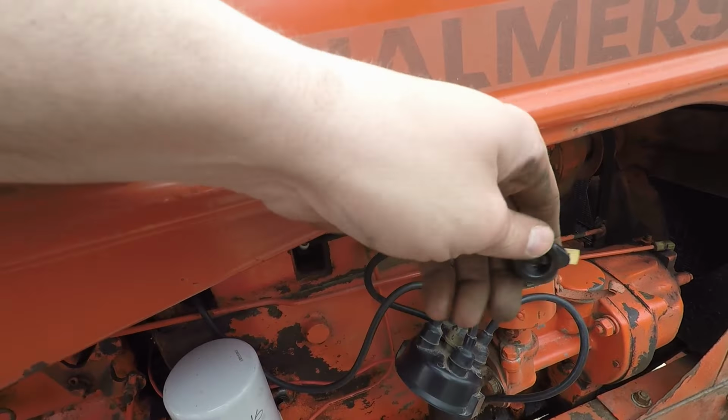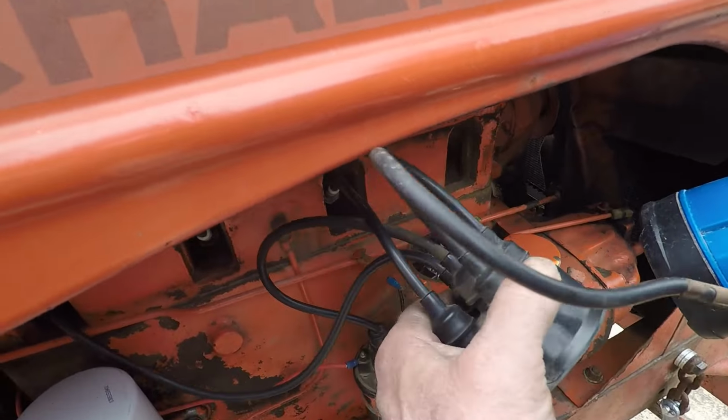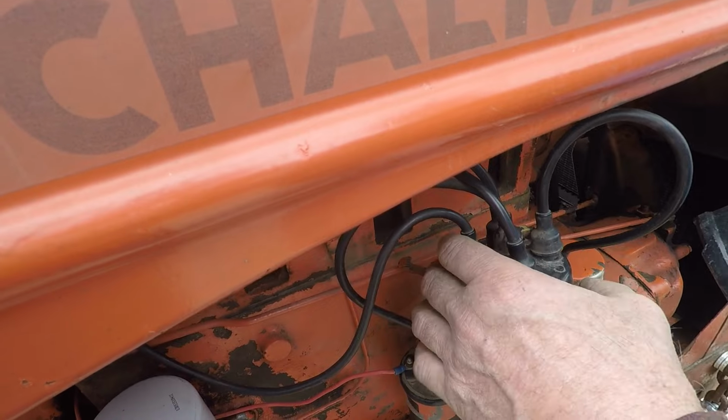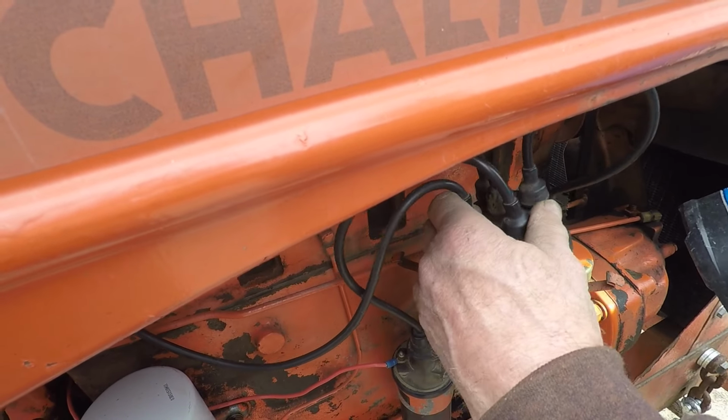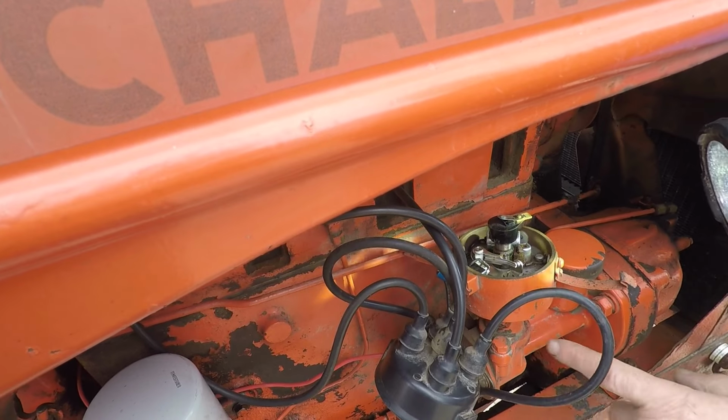Put that on first. And then our rotor and the cap, and that is right. So that's lined up with cylinder one. Yep, that's right. But the timing is way off. Right. So we need to loosen here